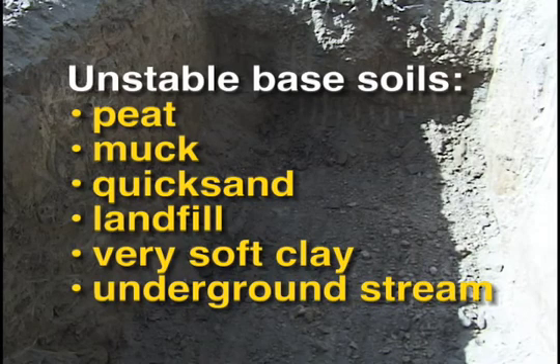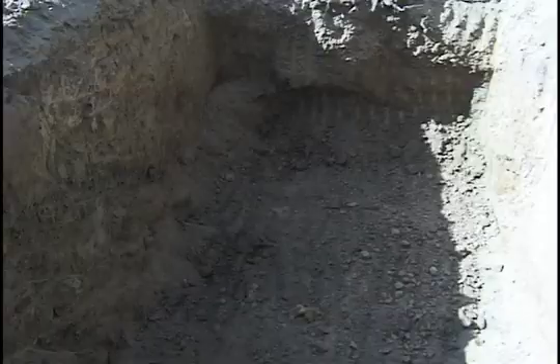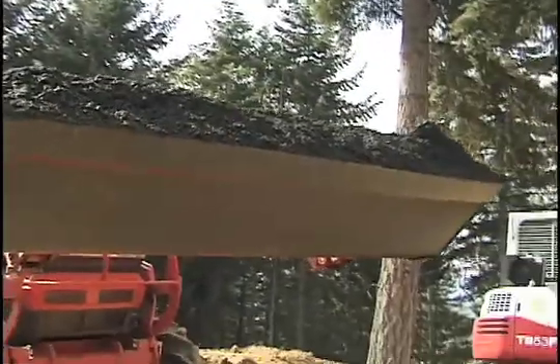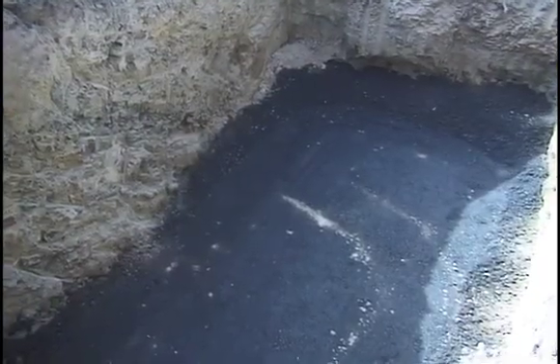It's likely that you will be advised to over-excavate the hole and set a firm, compacted, granular, or concrete base before adding the bedding. If the base soil appears stable, prepare the bedding. Place a minimum 4-inch layer of either sand or pea gravel onto the bottom of the excavation. Compact the bedding and make it uniform.